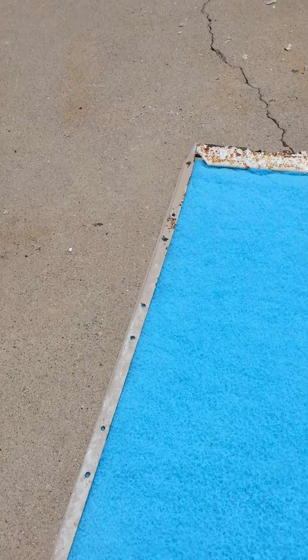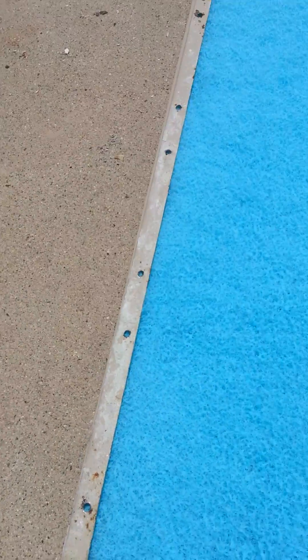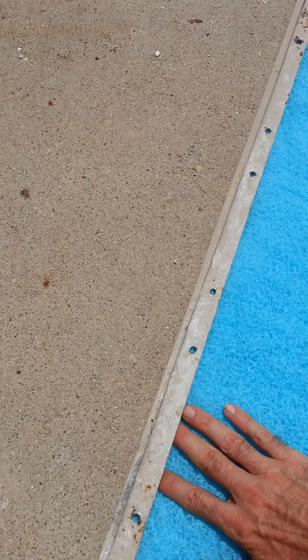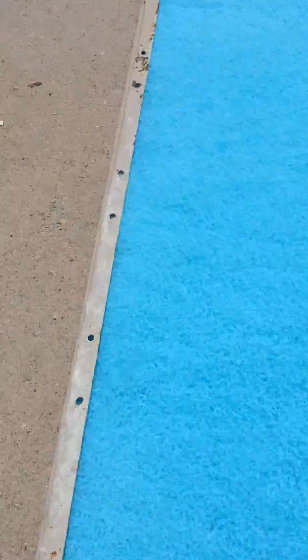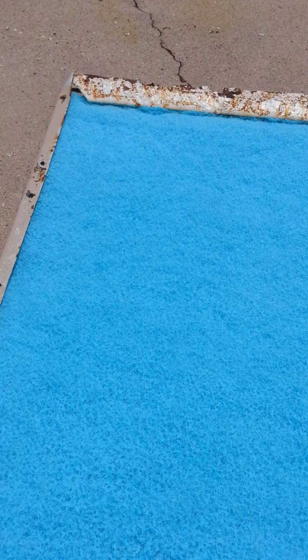When I first moved into the house where I'm living, it had the swamp cooler with the aspen pads, the ones with the little wood strings. First thing I did was replace those with the blue pads. At first I used a single blue pad, and then I realized there's a significant amount of room left over when I put in a single pad, so I decided to try putting in two pads. I noticed that the house became significantly cooler using the two pads, because the two pads provides extra area for evaporation.